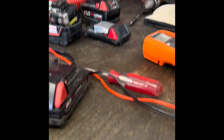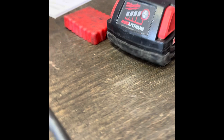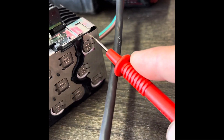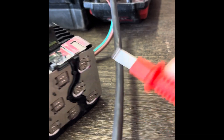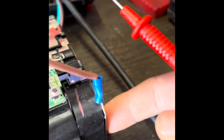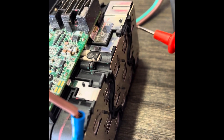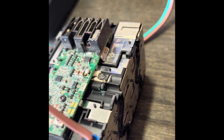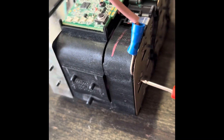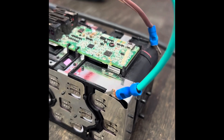You can test these cells and figure out your groups — look for patterns. That plate there groups three batteries together, and on the other side there's a much bigger plate connecting those three to the next three. This is the negative side. You figure out which group is not at the level of the others. In this case, the groups are at 4.08 volts each — 4.08, 4.08 — and then this one was like 2.9 volts.